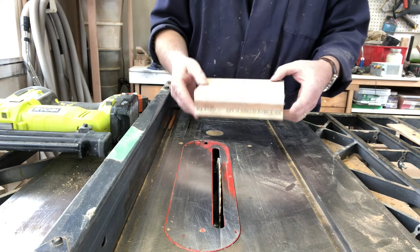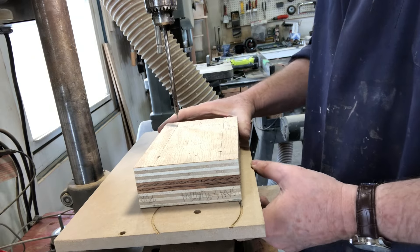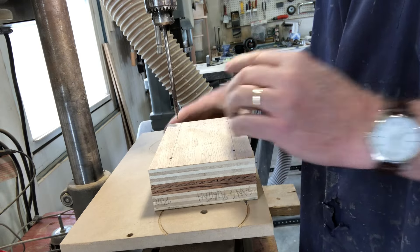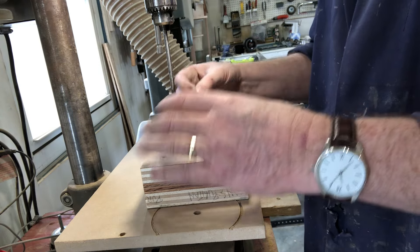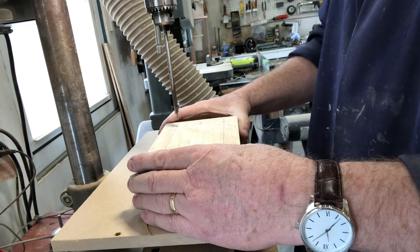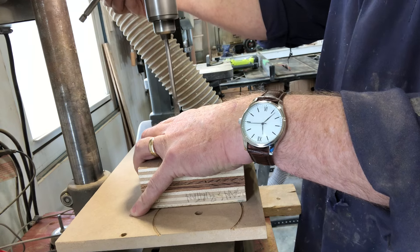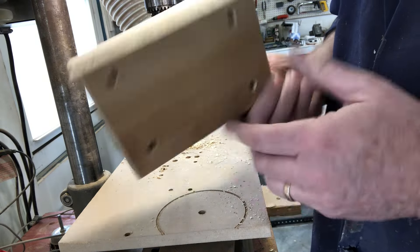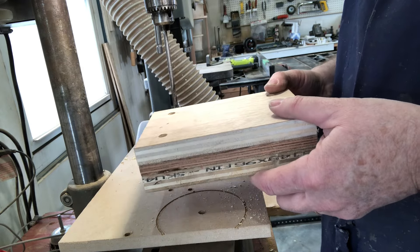Okay, that'll be good for drilling and then I can remove those nails when I'm done if I need to. The bolts I'm using to hold the motor on are 5/16 bolts, but I'm going to drill these holes out at 3/8 so there'll be quite a bit of wiggle room to allow the bolts to slip through and give some minor adjustment. Got nice clean holes going all the way through on both sides - alright, let's try setting the motor on the beam.